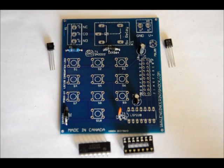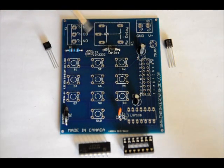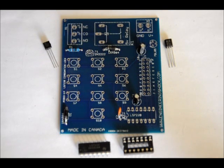To make things easier, we're going to do the transistor, the regulator, and the socket first. The transistor and regulator physically look the same, but the writing is different — one says 2N2222 and the other says 78L05. On the board, the footprint says 78L05, and T1 is labeled 2N2222, so make sure you don't mix those up or the circuit will not work. Be very careful, because you really don't want to have to desolder these. The regulator and NPN transistor have a flat side and a rounded side, and the footprints also have a flat side and a rounded side. From a bird's-eye view, line up flat to flat and rounded to rounded. If you have that turned around, your circuit is not going to work.